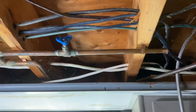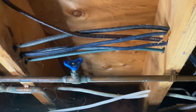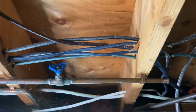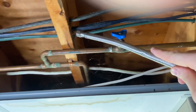I tried this water valve here. I put a temporary blocker on there just to test it, and the water valve indeed leaked. I was going to keep that valve and hook up another valve, technically having two — which is silly. But because this valve is leaking, I'm going to omit it. This hose is long enough that I can go past it and put the fitting on the other side, eliminating that leaking valve.